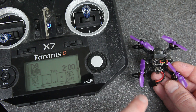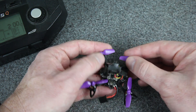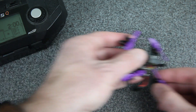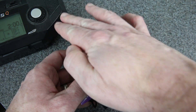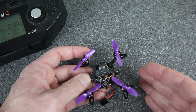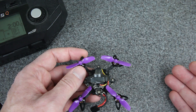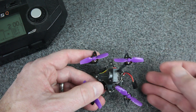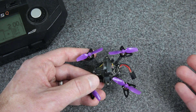I don't have to have one model for every single drone and remember what I called it. But there's another consideration: motor direction relative to the camera. If my camera is pointing this way and I'm flying forward, these props are spinning out away from the camera — that's the reverse motor direction or props out. But if I started flying sideways from that direction, these props are actually spinning in towards the camera, or props in. So if you do a 90 degree rotation and only adjust it on the radio, you're going to switch from props in to props out or vice versa. I want props out on this drone and all of my micros, and on bigger drones as well. If you want to customize that, you're going to be going into the flight controller and ESCs anyway.